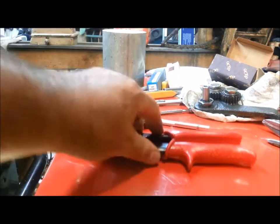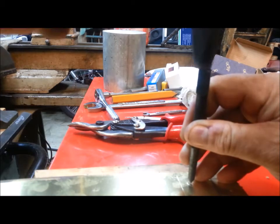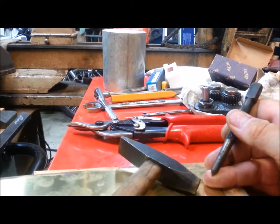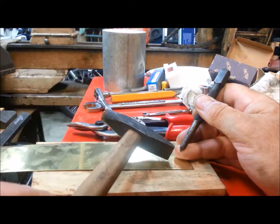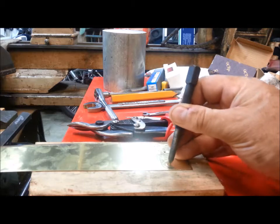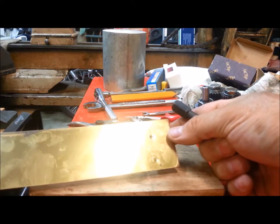I've decided before I cut it out, I'm going to go ahead and drill these holes while I have a lot of stock to hold on to. Yeah, it looks like a good central hole. The punch was rubbing up against the machine so my side of the hole isn't exactly round here, so I'm kind of centering it off of this crescent moon part of the radius. There we go. Go drill them out now.